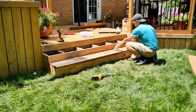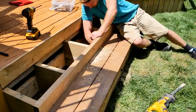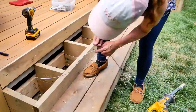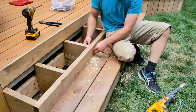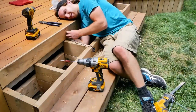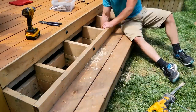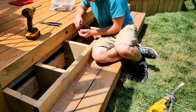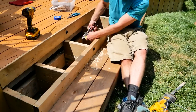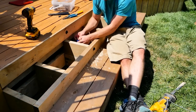I think that lighting goes a really long way when it comes to these kinds of projects. These are just low voltage deck lights — they're plug and play with one another and really simple to install. The only thing to address really is having the first wire get to the driver. Because my driver's a little bit of a distance away, I just took a wire and spliced the connections for the first deck light. It's a really straightforward process because it's low voltage, so you don't have to be concerned about anything going wrong.